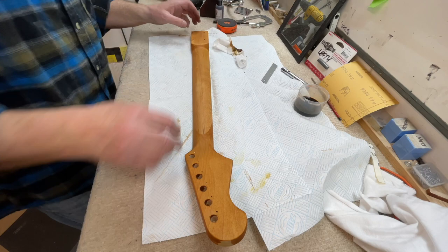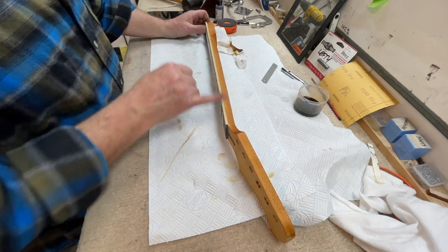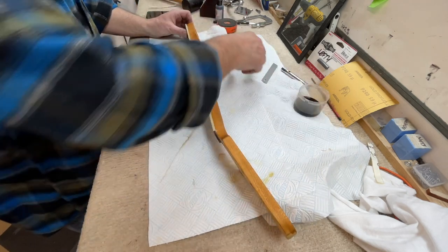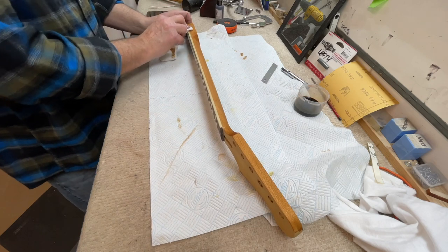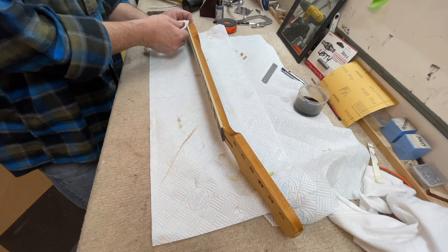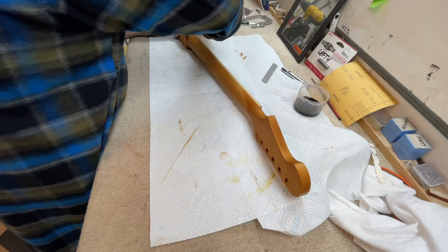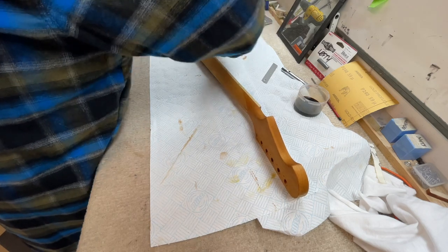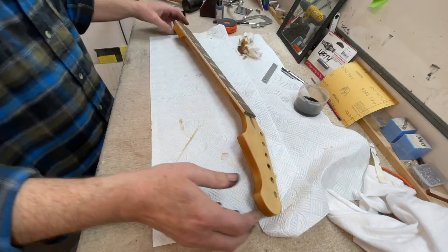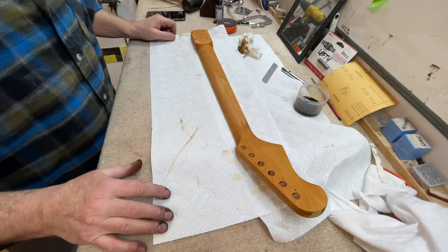In truth, by the time we get this done, that's hardly a change to the colour, and we probably could comfortably leave it the colour it is right now. If, on the other hand, by the time we've done the true oil, we don't like the colour it's got there, then we can scrape it back. But actually, if I take a bit of the remaining wet dye off there now, and imagine it a little bit down the line with some true oil, I think that'll be a perfectly fine colour.